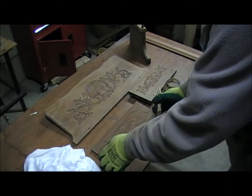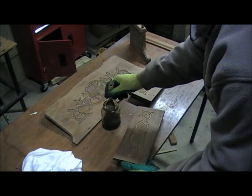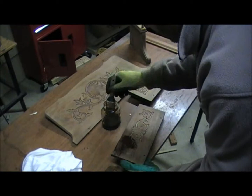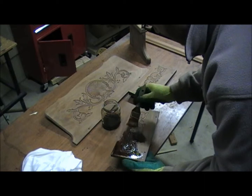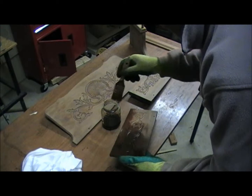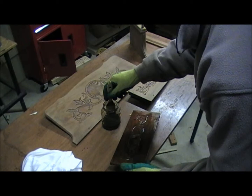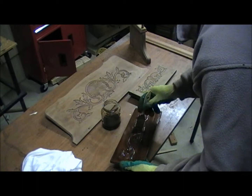I'm going to use a brush to apply the wood stain. This is a stain, not a finish — it's just to give the wood some colour. Dip the brush in some of the wood dye and just start brushing it on. I'm using the brush particularly to get it into the carving and just spreading it out all over. I'm not going to leave it on too long because I'm not looking for a very dark colour on the wood, just to give it a little bit of help. I'll put it on, not leave it very long, and then wipe the excess off with a clean white cotton cloth.